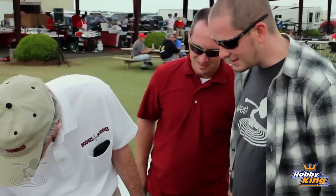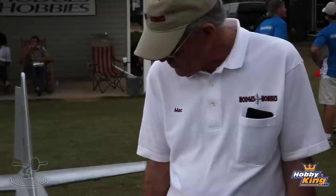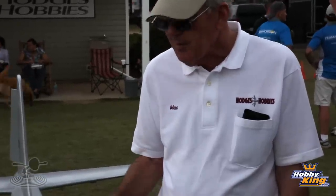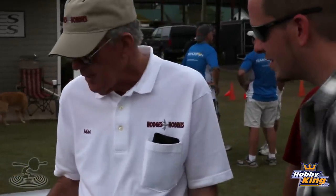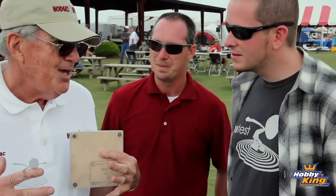And these are some little jumper plugs. I'm running A123s, two cells per receiver, and so I've got eight of those. I've got four receivers and charging them. When they're both tied together through a Y-harness, they both go to the receiver. The ground goes all the way to the receiver. The switch just switches the positive lead off. So you've got a common ground on those two.